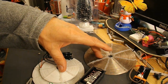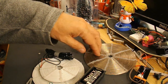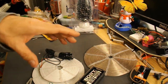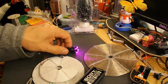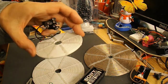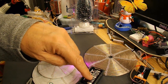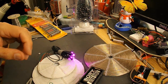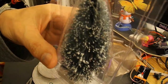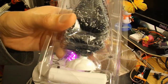I actually did some pancake coils a while back based on some work done by Mongrel Shark, which was based on some work by Slider2732, and I did that to light up a little bunch of LEDs which was to go in a glass bowl that my wife wanted to light up. I'm actually using a 9V battery here — Slider only uses a single AAA battery I think. I've also got quite a large resistor in circuit just off screen. The idea will be to put some sort of coil underneath this tree so that it picks up the power and lights up its fibre optics, which no doubt just go back to a single LED in the base somewhere.